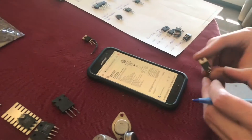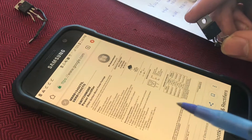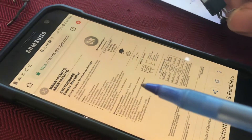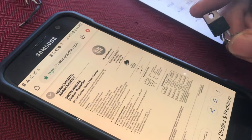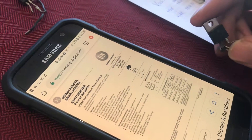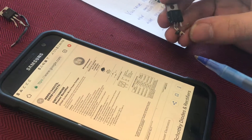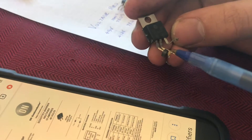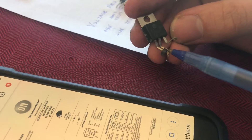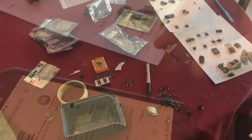Searching B1545, sure enough I found a datasheet from On Semiconductor for the B1545, and it is a Schottky power rectifier. There are two diodes in here — it looks like the cathode is the center pin, and then you have the anode of one diode and the anode of the other, so there's two diodes.